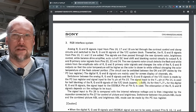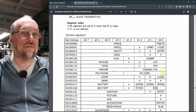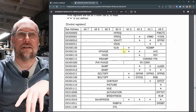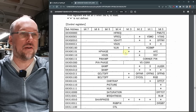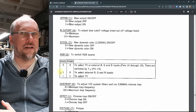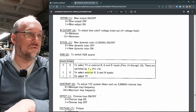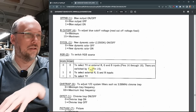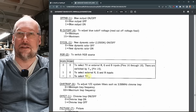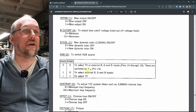If we keep scrolling through the datasheet, it lists all the I2C command registers for all the various features of this chip. Luckily, a lot of this stuff is exposed inside the service menu on the set, allowing us to fiddle with settings without having to hack the microcontroller — which would be pretty much impossible since it's a custom Sony part. Here's the particular register for controlling the analog RGB: zero-zero instructs the processor IC to use the YS pin 15 to switch between analog RGB or the YC; one-zero always sets external RGB; and one selects the YC block. We're going to keep our fingers crossed that this is set to zero-zero, which allows us to manually control the RGB input using pin 15.